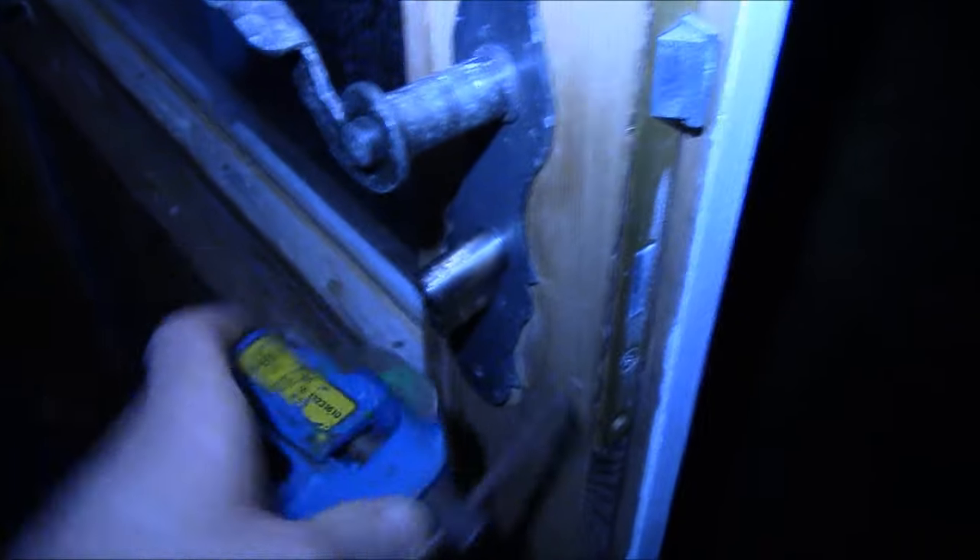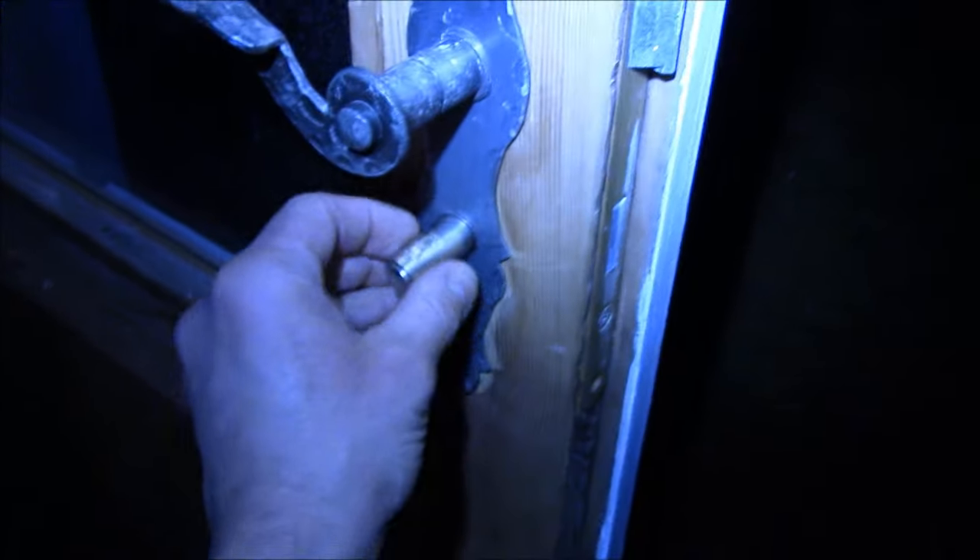I told him I would try again the next day, but then I realized I had another chance. You can see the cylinder here is standing very wide out of the door, so I tried the snapping attack. I used my little vise, opened the jaws, clamped it really tight, and jiggled it left and right and up and down — and very quickly this lock came apart.